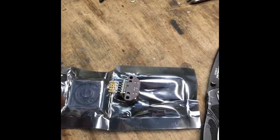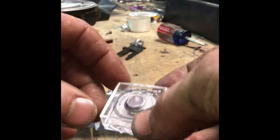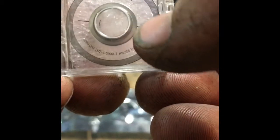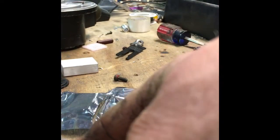These things are 5,000 pulses per revolution. Let me open this up so you can see - yeah, 5,000 pulses per revolution. They are differential encoders, which work with my controller. You can see the optical disc in here; obviously you can't see the little lines, but this is where your index pulse is. This little disc goes inside the encoder body and gets read by the reader.